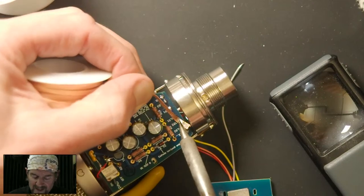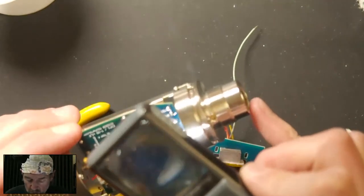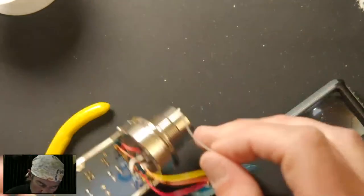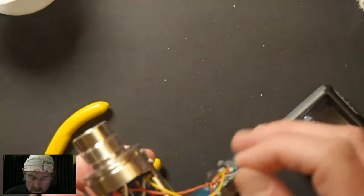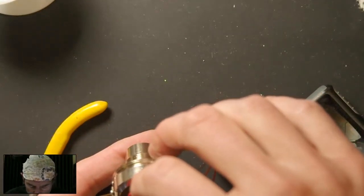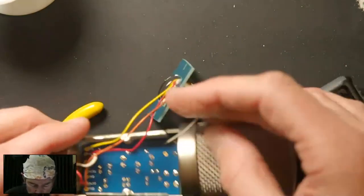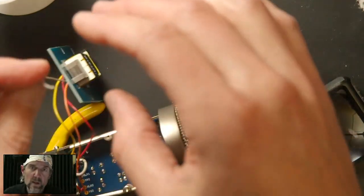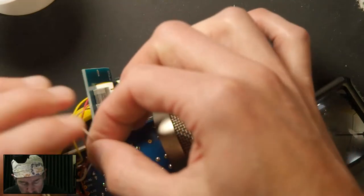Soldering wires is easier if there's a hole, a solder pad that you can put the wire through. Now, I'm not going to have that kind of luck tonight. So plan B is you can surface solder them, or maybe just try to wedge it in there. If I wasn't doing this with an audience, there are tools that you can use to sort of plunge the hole out.